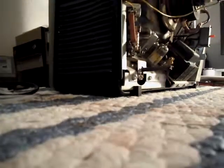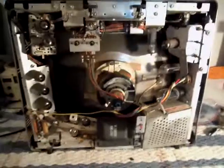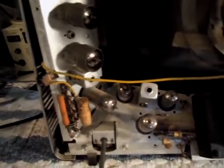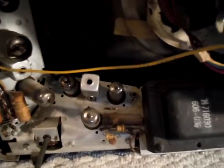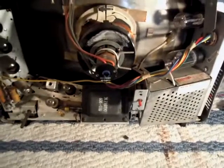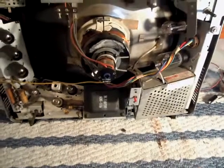I'm just going to turn it around so I can show you the chassis. I'm very impressed with how this machine is made. Look at the chassis layout and how it's wrapped around. You start here at your tuner, go through your first three IF stages, here's your sound and video power transformer, flyback, and sweep sections. The thing that really impressed me is that this is a portable and they have a real power transformer. Very impressive.